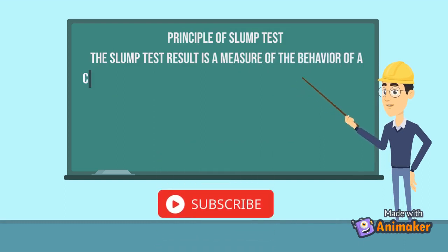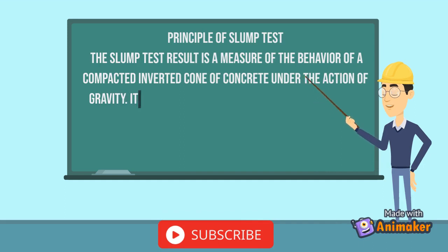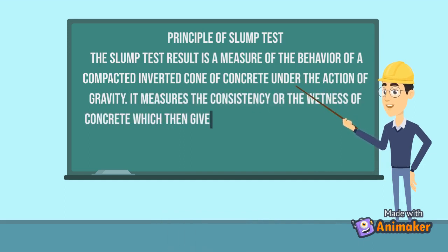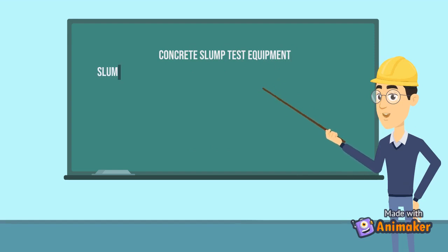The slump test result is a measure of the behavior of a compacted inverted cone of concrete under the action of gravity. It measures the consistency or the wetness of concrete, which then gives an idea about the workability condition of concrete mix. Now let's see the apparatus required for it.